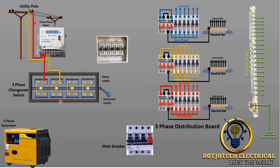I need to explain this. This 3-phase changeover switch has 4 sides, and each side is separated — they are not connected to each other. Each side has 4 terminals. Out of these 4 terminals, 2 have been connected together, while the other 2 are separate. And the same applies to the other sides of this changeover switch.